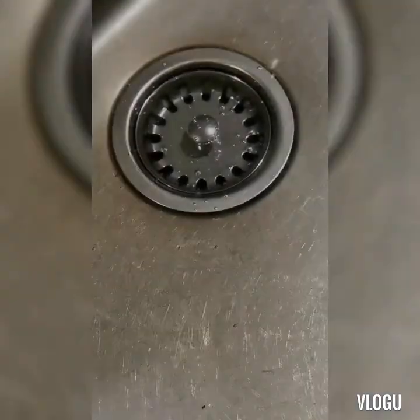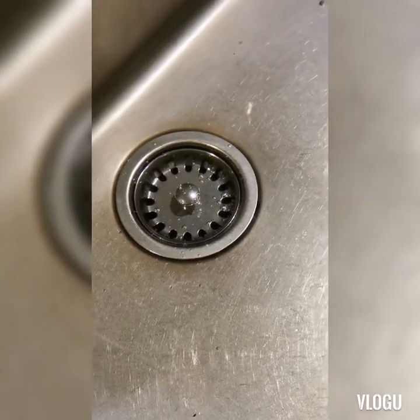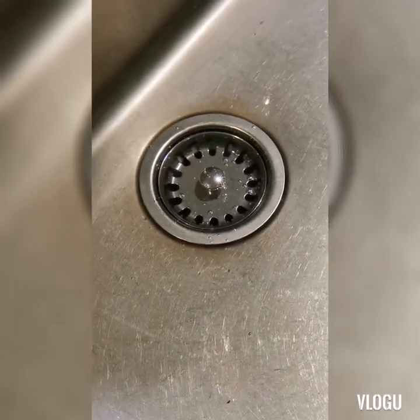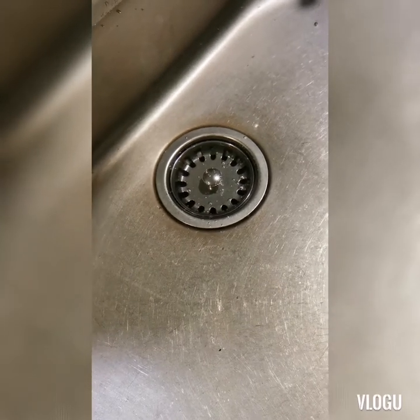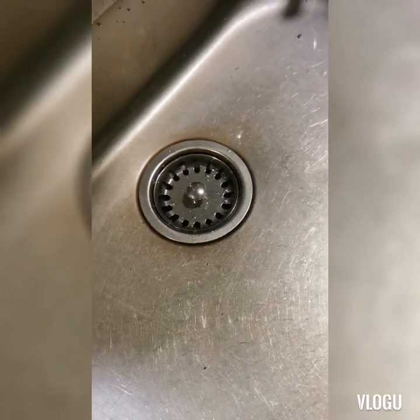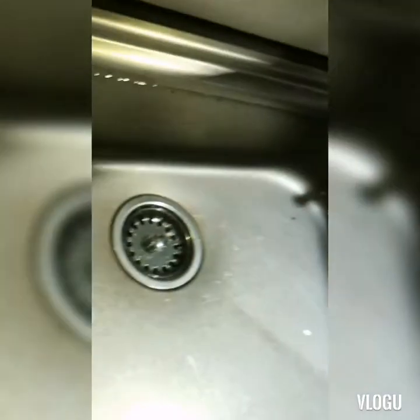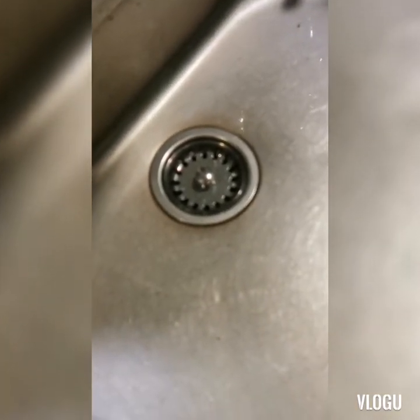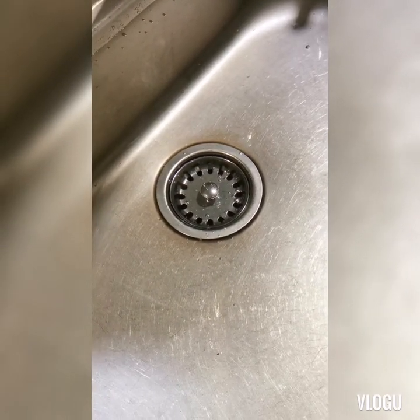Leak test for the new plug. One thing I found is that when I tightened the centre screw down, it bottomed out on the housing before I'd consider it tight enough to seal. So I've left the original seal under the top plate plus the rubber. There are no apparent leaks at the moment and the plug hole doesn't appear to be passing water, unlike the old one. We'll see whether it actually leaks at all - I might have to modify it.